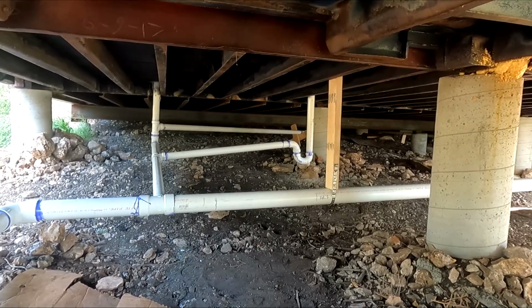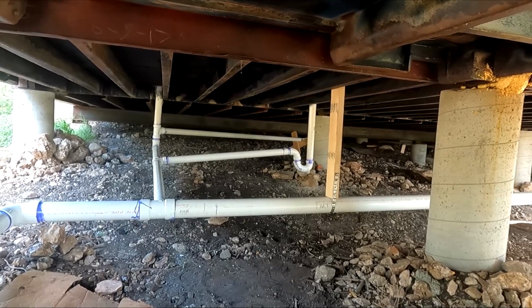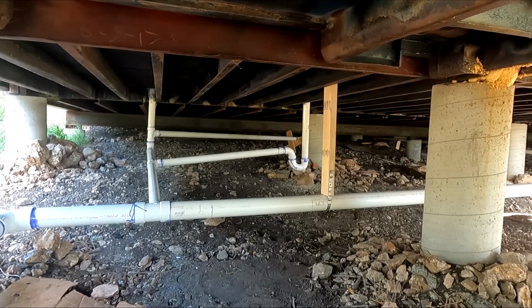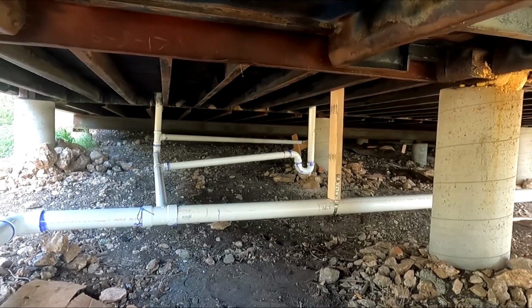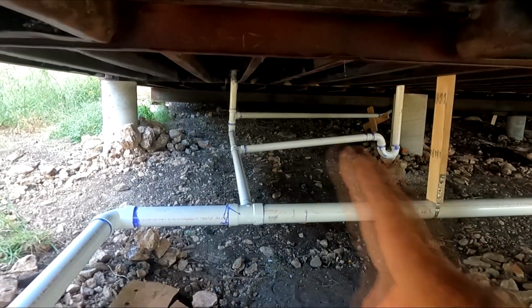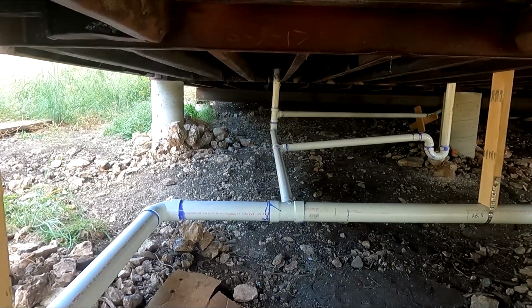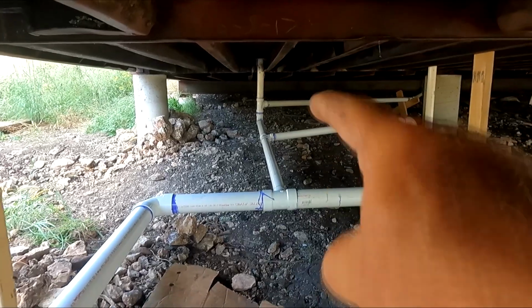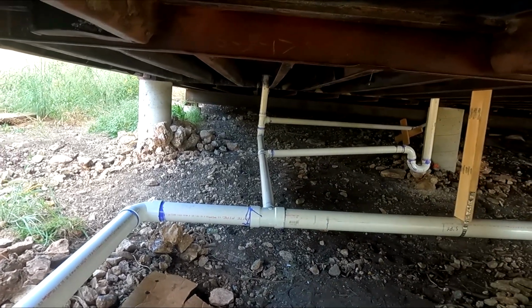It's not a conventional house where they put everything through the walls and have a whole bunch of holes and 2x. So we just went straight out the bottom of the floor. This hole was very easy to do. A couple extra sawzalling, but aside from that, pretty straightforward. The pipe you see way back right there, that's the air line or vent line coming from the island, and that right there is just a vent tube going straight up to the attic and then through the roof.